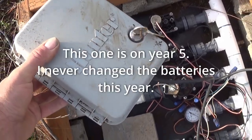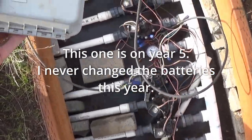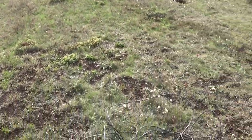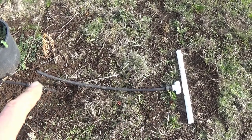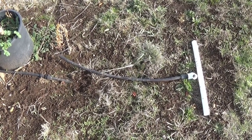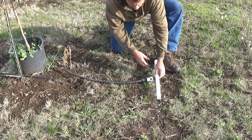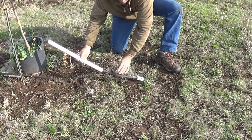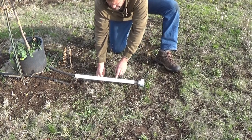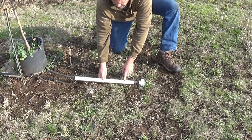The little Hunter battery controller — these are great. They take six AA batteries and you can use a controller per bank. I got four more of these banks to do, but I'm replacing it, running it all the way up to the ICC across the field. This short run of poly is not supposed to be buried — it's subject to being crushed and collapsed from traffic, and gophers and mice will eat right through it. If this section of poly is getting crushed and eaten, you can use a piece of PVC — slide it on down and that will prevent it from being eaten. The gophers won't chew through the PVC but they'll chew through the poly real easy.